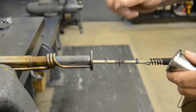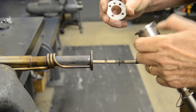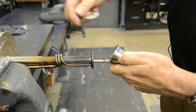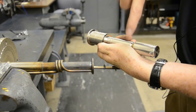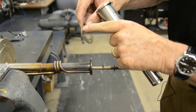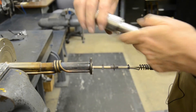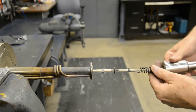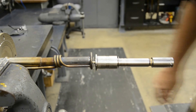When you go back to put the new cell on, you have a brand new flange. If you'll notice, this flange has five holes. Four of the holes are for the Allen screws. The fifth hole is to allow the calibration gases to go through here, through here, and into the cell body and out this hole right here, which will then bathe the outside of this cell in calibration gases. To put this on, you align the fifth hole up with that tubing, then locate the hole on the cell body and align it up with the fifth hole on the flange gasket. You'll have a slight spring tension as you go back together, then insert the new screws.